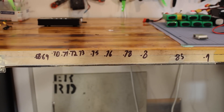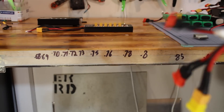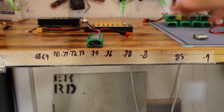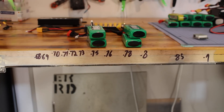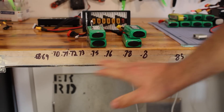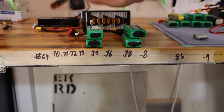Here's a good tip for keeping track: after I measure each battery, I record what the first cell voltage is and stick it on a little strip. I have a strip marked from about 0.5 to 0.9 (representing 3.5V to 3.9V) and I place each battery at its corresponding cell voltage marking. This makes it so much easier to find groups of batteries with similar cell voltages to put onto the parallel charger together. It's especially helpful if you have a lot of batteries to track.